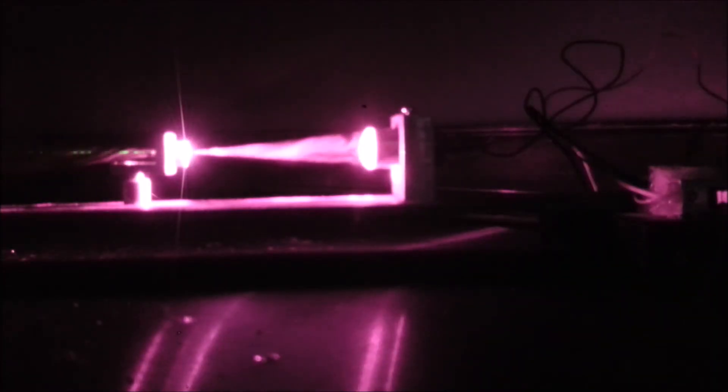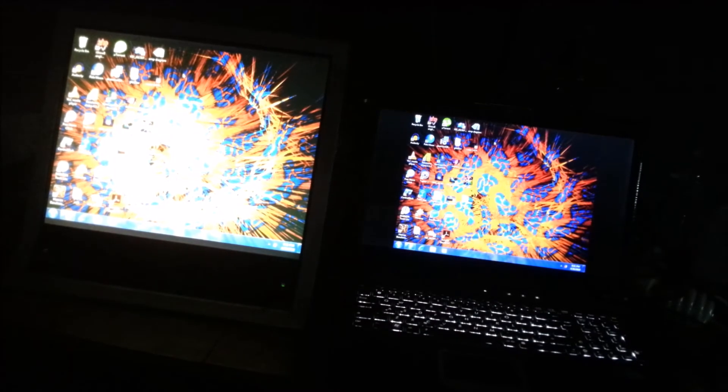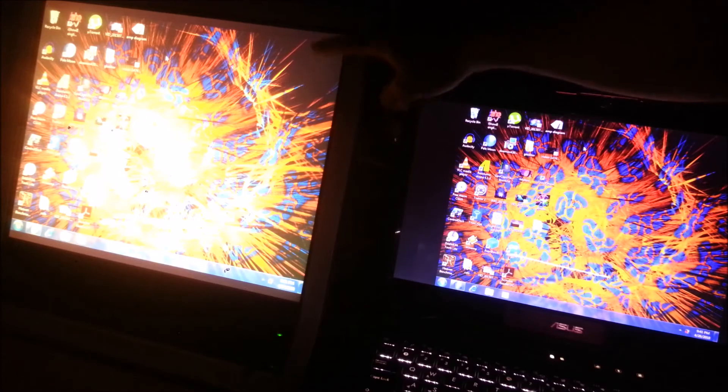Here's a side profile to give you more of an idea of what's going on in the optical path. On a normal camera, we have on the left a CCFL backlit LCD, and on the right an LED backlit LCD. On the modified camera, you can see just how much IR comes through the CCFL panel compared to the LED backlit one.